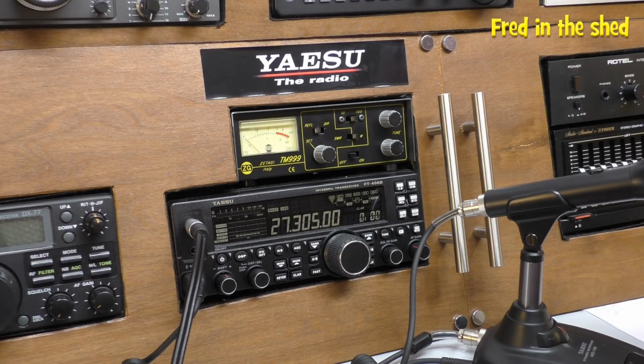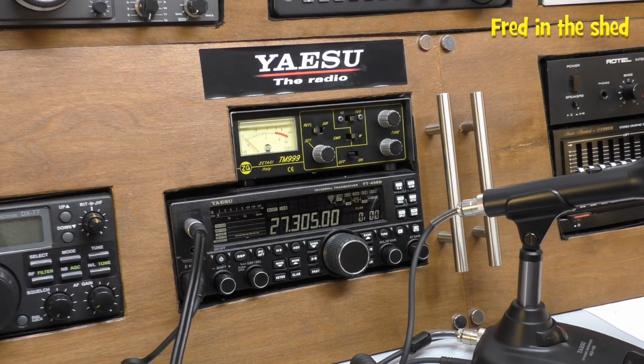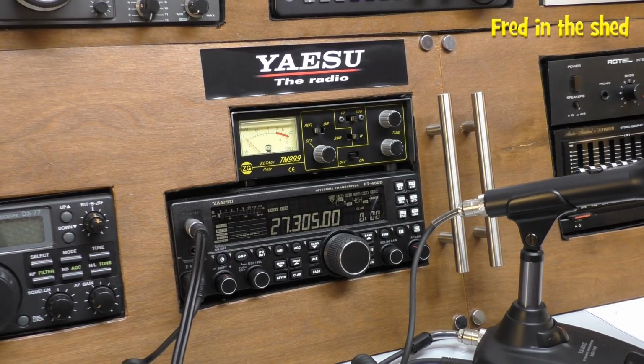John, back to you. Well, it isn't the fiberglass I have the issue with. It's the fact that all these fiberglass aerials have going up the middle of them is a bit of wire. That's all you've got, that is your aerial, is that bit of wire. With an aluminium type aerial you've got more surface area to radiate. It radiates on the surface, doesn't it? You know what I mean? So the more surface area, the better.